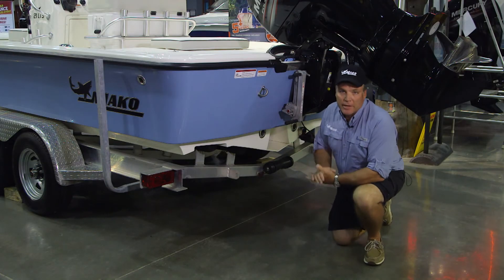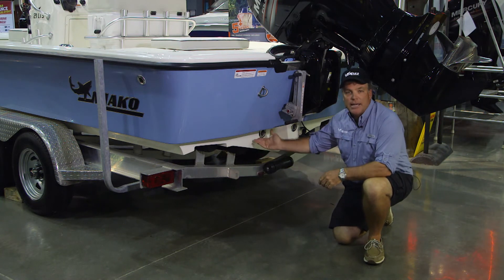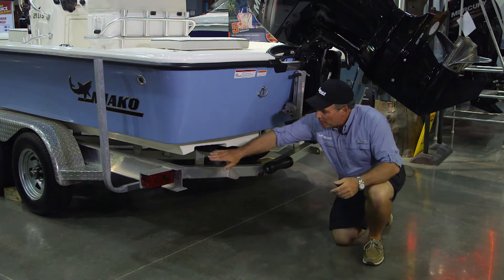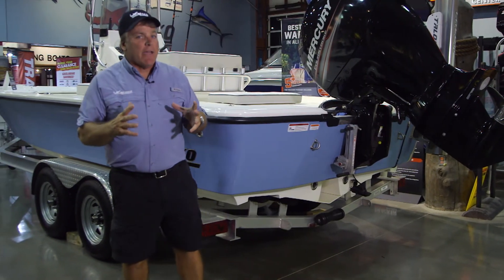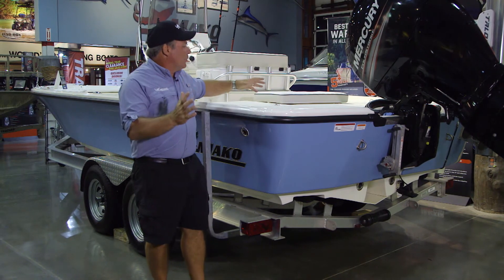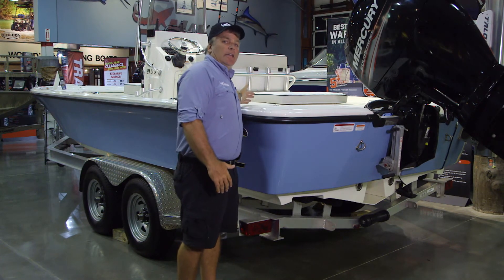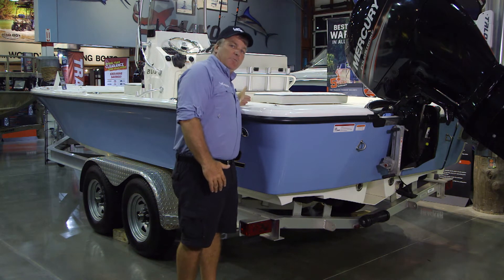There are a couple of other things going on here. Part of the rapid planing system, the RPS hull, is a step — a U-shaped step built into the bottom of the boat that is elevated up above the bottom of the hull. One of the great features of having a stepped hull integrated into the bottom of the boat is really shown when you're up on plane and running. By having a U-shaped step hull, we've actually given the boat a shorter running surface from this point forward.